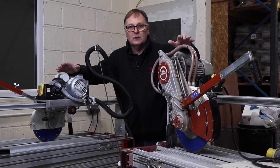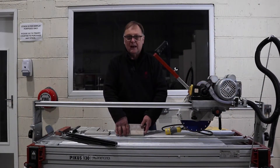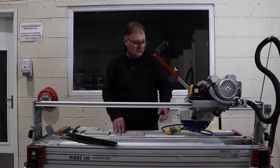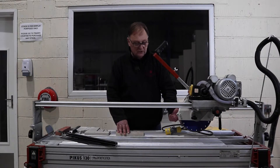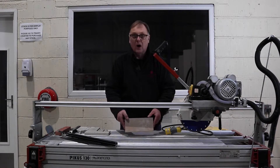Not Indian stone — sandstone, a very abrasive material. One of the main problems we get asked here at Tiler's Tools is why is the saw cutting out of line? 99 times out of 100 it's because you're not looking after the blade, or the blade is spent or it's been overworked on the porcelain.